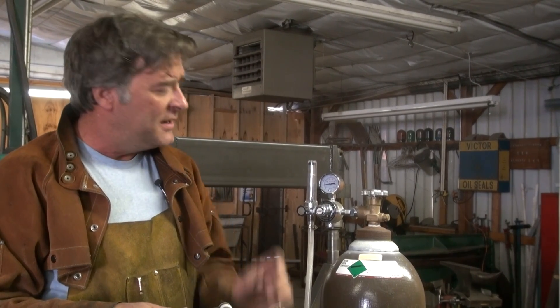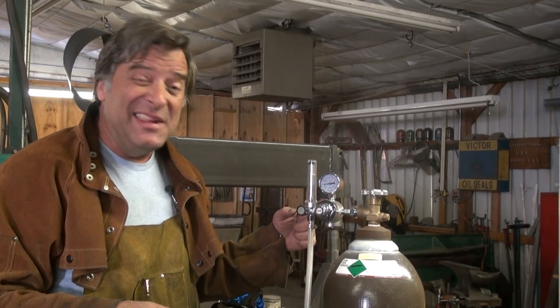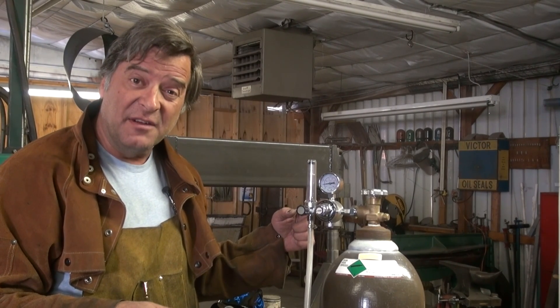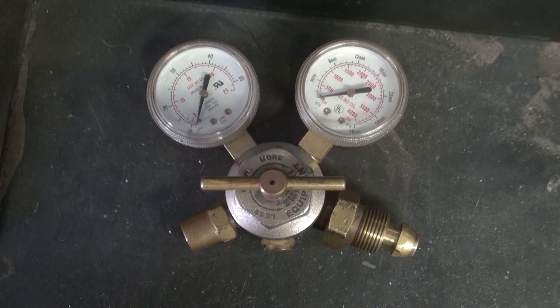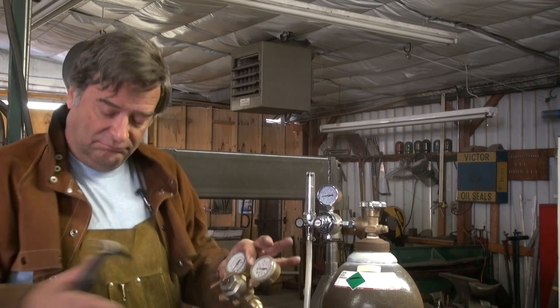What do they cost? You can buy these anywhere from about $80 at Harbor Freight up to a couple hundred or $300 depending on which model you get. They even have them with two outlets so you can set up two different machines — like your TIG welder and your plasma cutter — off the same bottle with two different flow meters. Those are the more expensive ones. The more traditional regulator style, which just shows you the working pressure rather than working volume, is maybe about 25% cheaper. Hope that answered your question — I'll see you next time.